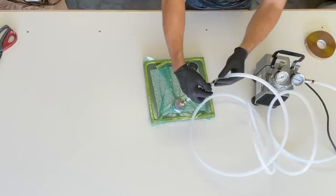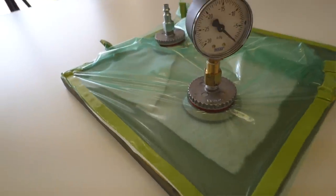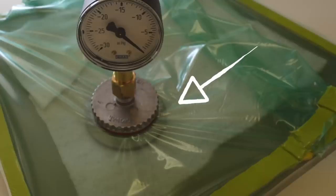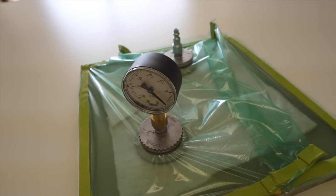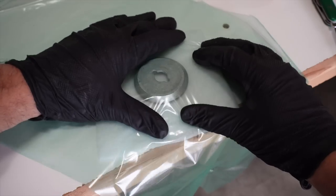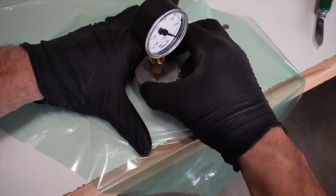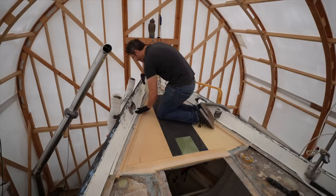Careful viewers might have already spotted the problem here. When I put the air connectors on, I didn't stretch the material very tight, and so there were small creases underneath the mating surfaces that caused very small air gaps to form. When you're putting those things on, you really want to hold everything really nice and tight in position, and then screw those down as tight as you can to get a good seal. So things here seem to be working pretty well.